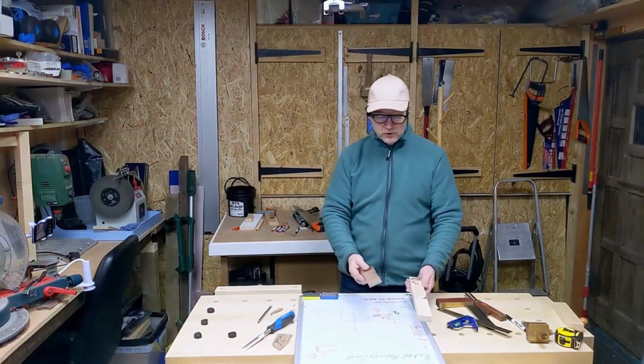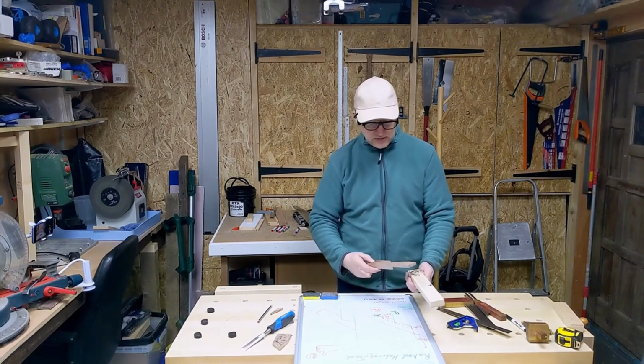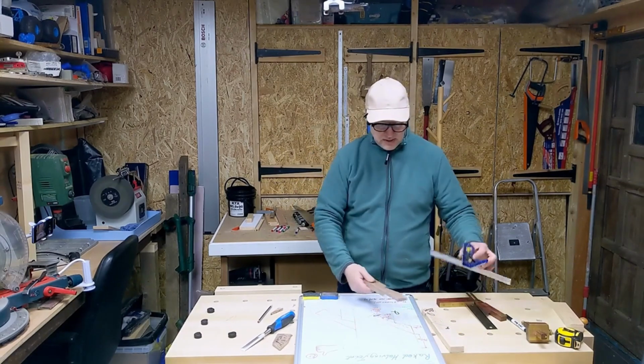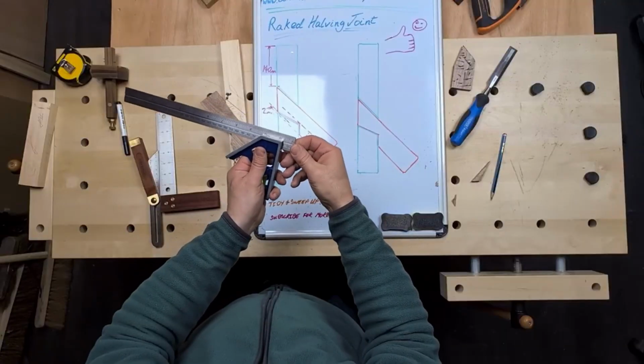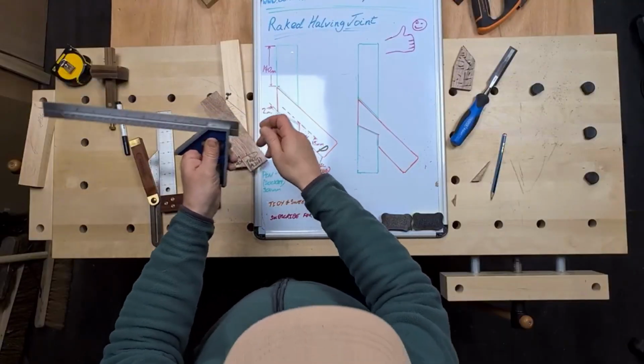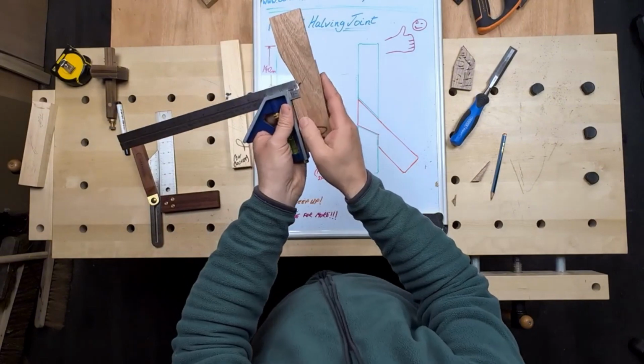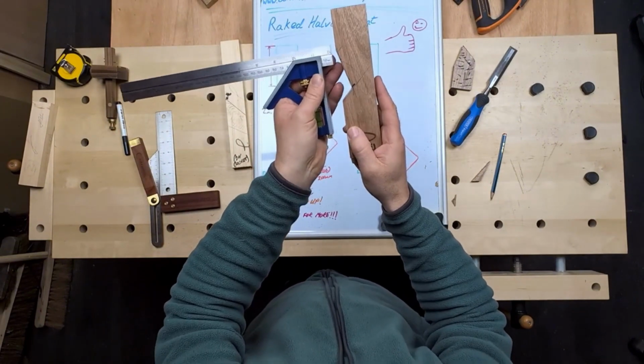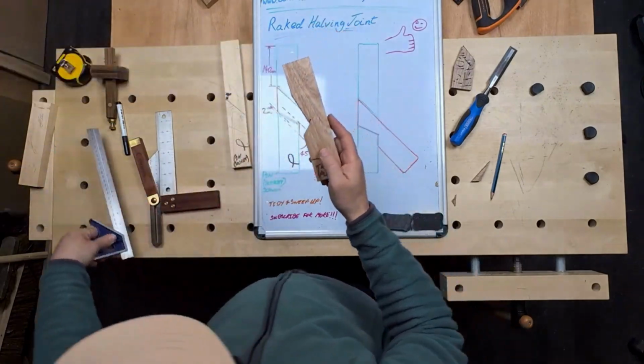So we're going to check our working drawing. We've got our face and edge, and continually coming back to this. If we want to check our measurements on here, put your combination square onto 15 and see, have we come in there at 15? Pretty close on that one. I'm not going to measure the two because this could get cut off there somewhere.